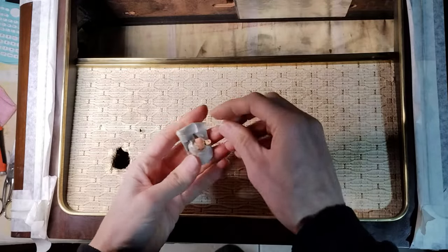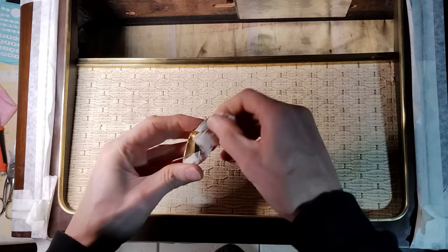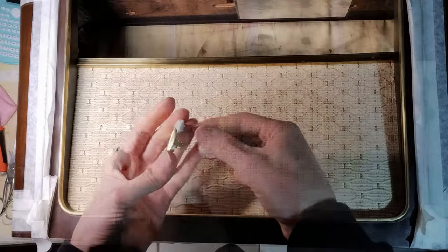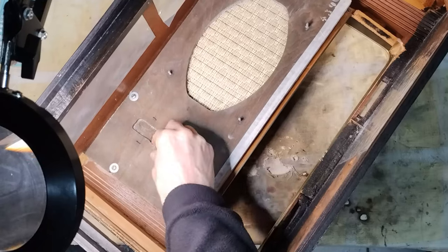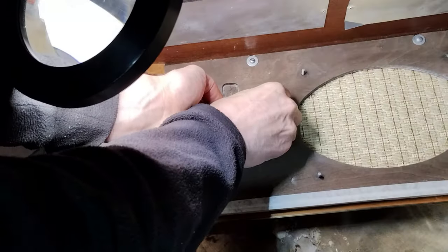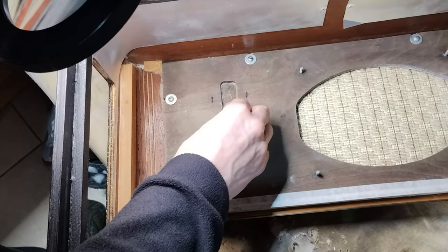The magic eye escutcheon is made of brass, but it was painted around the hole by the factory, probably to avoid the glare induced by external sources of light. So the escutcheon was masked and painted with a golden paint. To fix the escutcheon to the panel, instead of nails, two brass push pins are used. In case it were necessary to remove the escutcheon again, that would be easier.